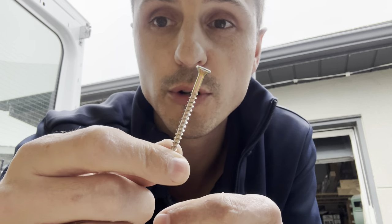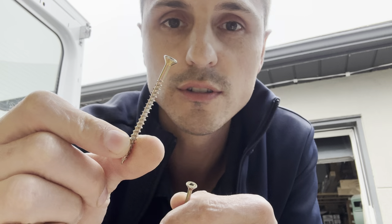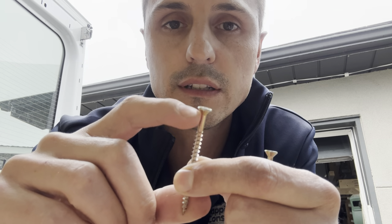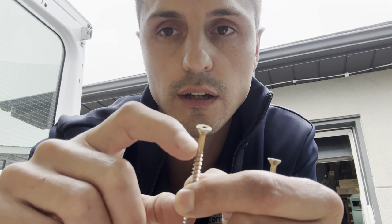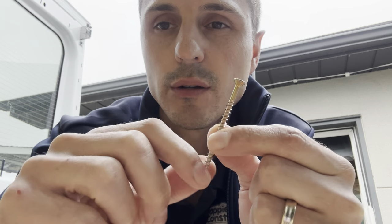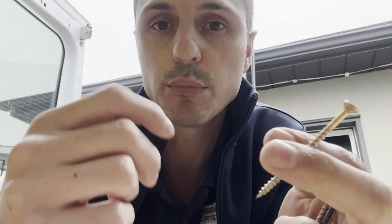Check these out. This is from Home Depot. This is a two and a half inch framing screw. The thing with this screw is check out the throw on this thing — it's about a half an inch. A half an inch is not enough. This is good for sheathing, but then this is way too long for sheathing — it's almost unnecessary. Sheathing is like plywood and things like that.